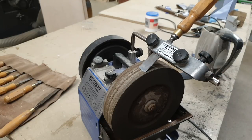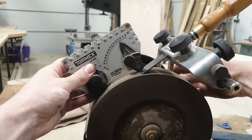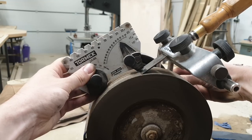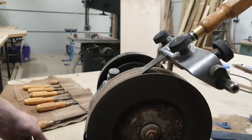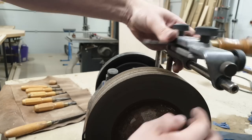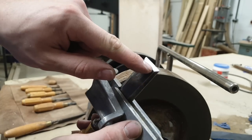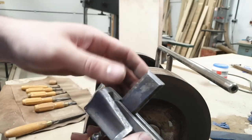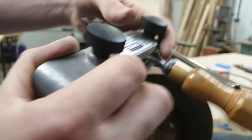Adjust the height wheel on the back until there's no light gap behind that piece of plastic — that gives you the correct bevel. For a critical chisel, paint the back of the bevel with a black ink marker, give it a couple of turns on the stone, then look where it's ground. If it's touching the heel, raise it slightly; if touching the toe, lower it. That's how I get the bevel I want, then just grind it away.